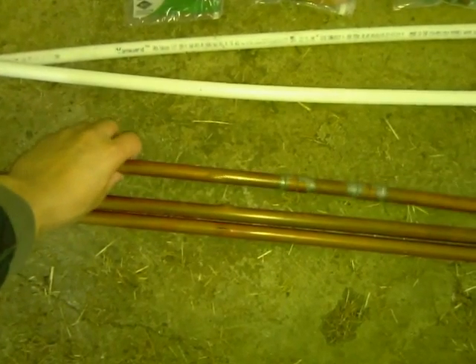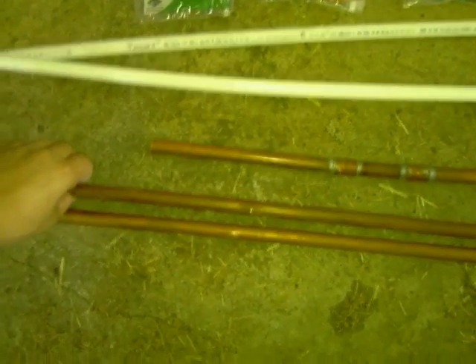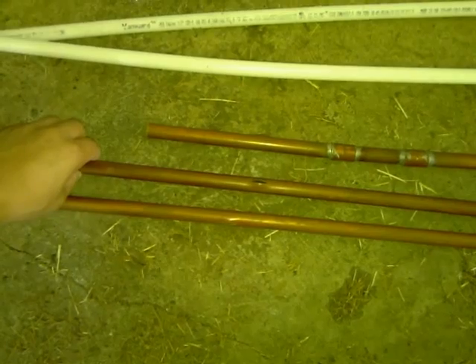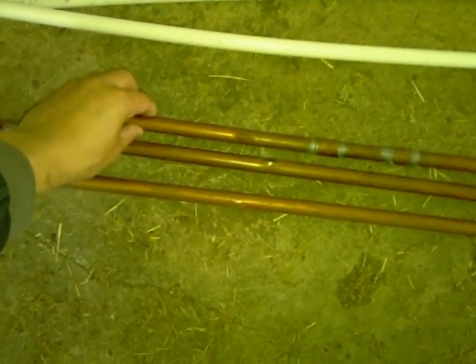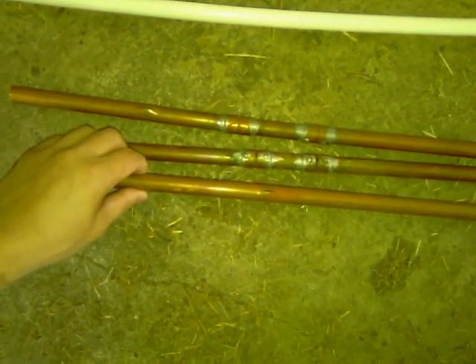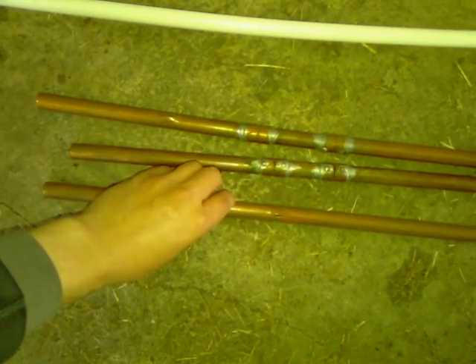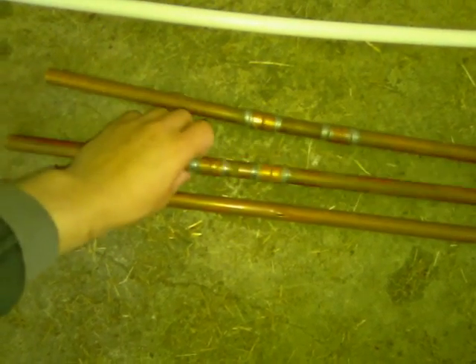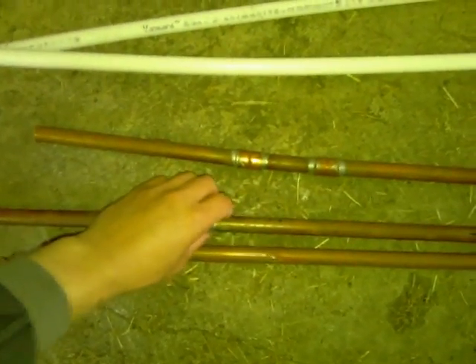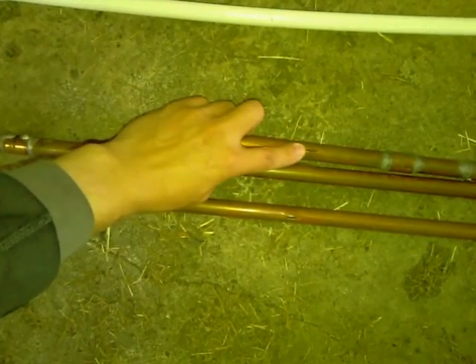What we have here is the old copper piping, which is the bad piping. I've got about 12 feet of piping here that I've removed from the attic crawl space where the pipes are above the ceiling. You can see these pipes have been patched in the past — it's not a good situation for where these pipes are at. They freeze up and burst. Right there you can see the slit where the pipe burst in that piece. This piece has a similar break down here — this one's a little bit bigger. See it bulges out and splits. And another break right there.